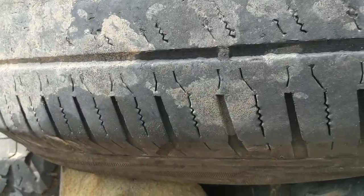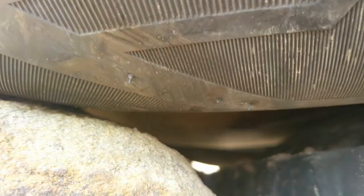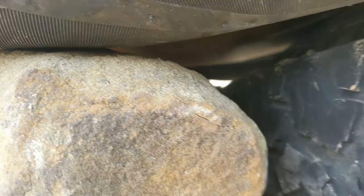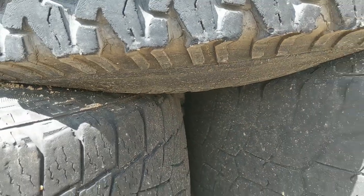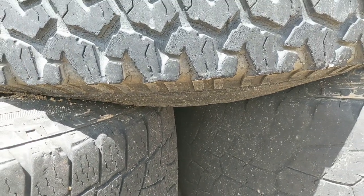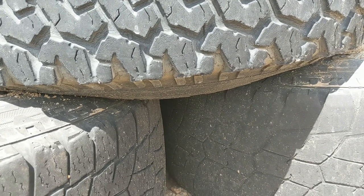I'd like to have my tires level, so I put these stones under there. You can see the cardboard is holding up quite nicely. It will be pounded more and then we'll reach the other tires too and kind of knit in. Like all of them, they knit in. See, they bulge out on the bottom, so they can't go left or right, or front to back really. It's really wrapped around. That's what makes the wall strong.